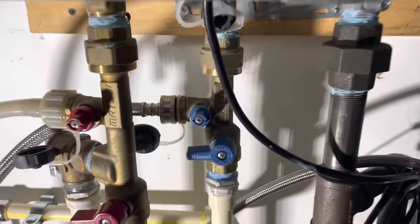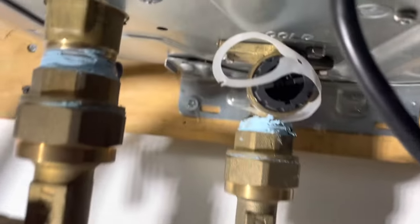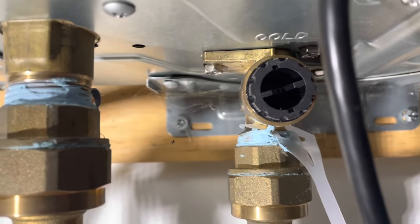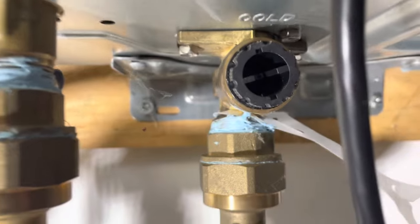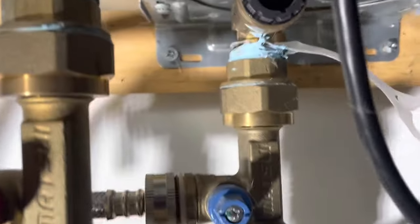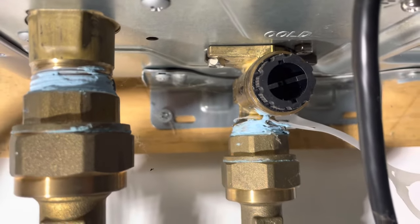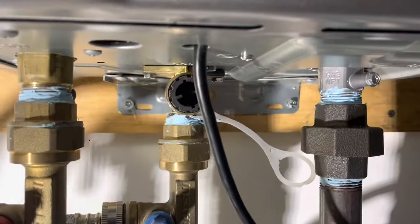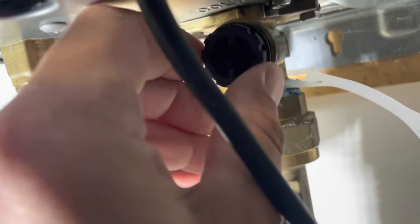After you drain it, the first thing you're going to want to do is pull that little plug right there — there's a filter screen in there. You want to clean that before and after the flush. Be careful with it though, sometimes they're hand tight; this one is not. They are plastic so you can break them. Be aware that once you pull this there could be some water still in the water heater that comes out — you can hear it's steadily still draining. There are some shoes and stuff here so I really don't want to make a mess on the floor.